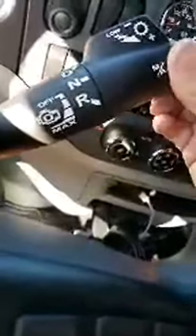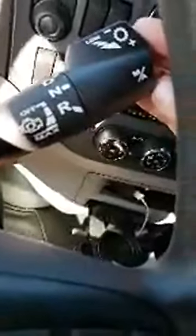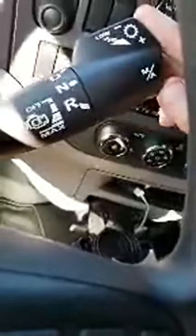So anyway, just to recap: if you're driving down the road, let's say 55, 65 miles an hour, and you're coming up to a steep hill, go ahead and click it down, either 1, 2, or 3, whatever compression you need. Down a steep hill, I put it all the way down. Use the full engine to hold 80,000 pounds, even a light truck, but it's up to you. You decide if you need your compression brakes, your engine, to help you go down safely down a hill.